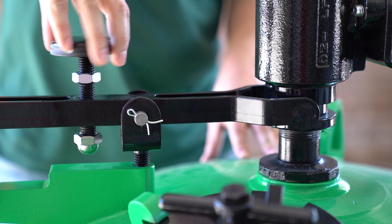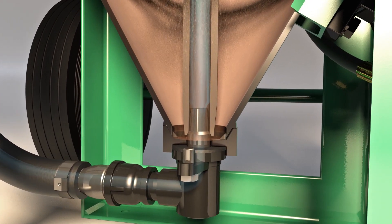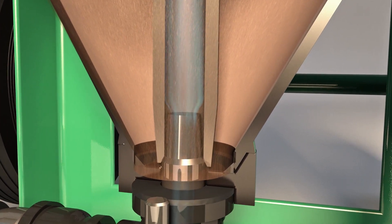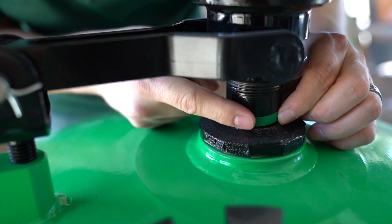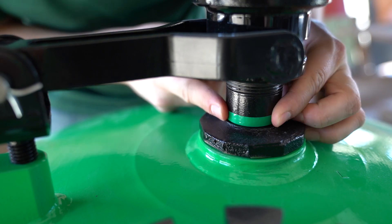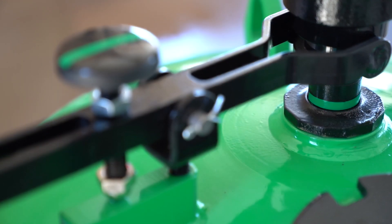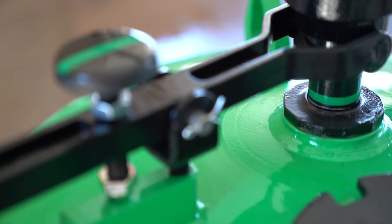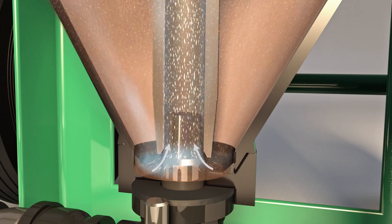We need to start with this all the way locked down. In this locked-down position, only air will flow through the outlet pipe. I put tape on my knob to make it easier to tell where a quarter turn is, and marked the zero point of my outlet pipe so it's easy to see it raising. You'll notice each half turn allows the outlet pipe to rise by about an eighth of an inch, which allows more media and water to get sucked into the outgoing air stream.